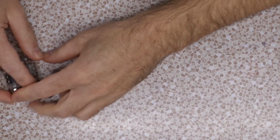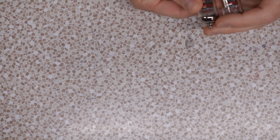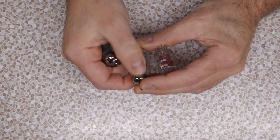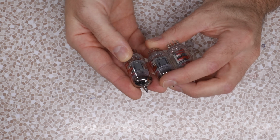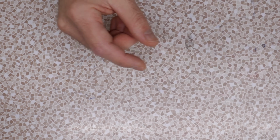Now, of course, the tubes they give you with this amp are clearly Chinese. There's an A, a B, and a C. Now, there are A and B models of the Shuguang 12AX7 tubes, which they've labeled ECC83 to just keep it with the British vibe. But then the C, well, there are Cs too. They would be like some sort of premium version or a selected version that has slightly better specs. That would be in the phase inverter.